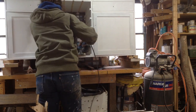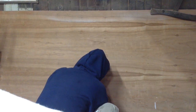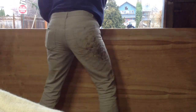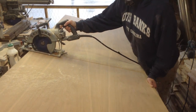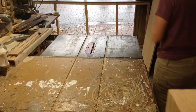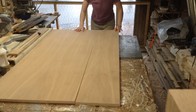This is the cabinet with primer — I put a coat of primer on which I did not film at all. This is a shellac-based primer from Zinsser. I put two coats on there because it's a very liquidy primer. I like it because it dries in 15 minutes, being shellac-based, but it goes on pretty watery so I usually put two coats. I've had this piece of cherry plywood attached to the front side of my door for a couple of years — I needed it when I was making a cherry bed and had to buy two sheets of ply but only needed part of the other one. It worked out perfectly that the customer wanted the cherry top, and I happen to have this plywood on hand. It was a little bit cheaper for them versus buying hardwood lumber, and I like that it's dimensionally stable.